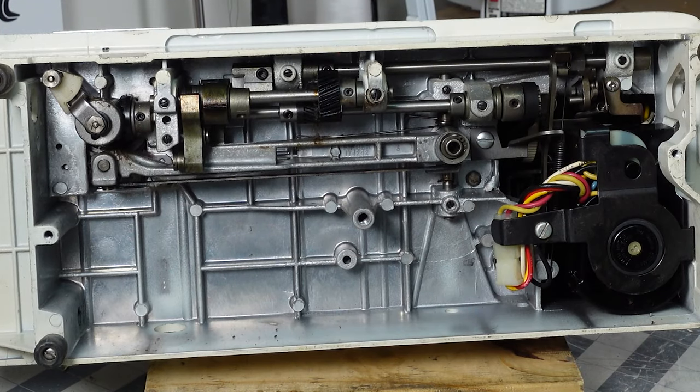When you look at a new machine that you haven't looked into before, you gotta look for a few things. So if you're gonna do your hook timing on a machine, you've gotta figure out, how do I adjust the timing where I don't adjust something that I don't want to adjust? That was a couple of negatives. So I wanna make sure I'm only adjusting the hook timing.